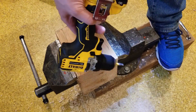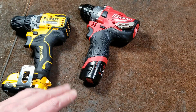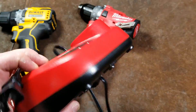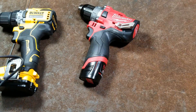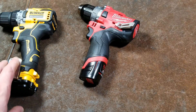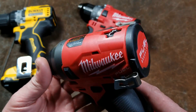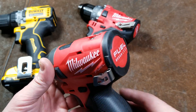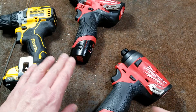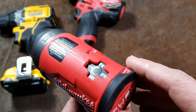With the 2-amp batteries both tools are closer than expected, but Milwaukee is still definitely more powerful. The DeWalt sets came with a 2-amp charger while the Milwaukee has a 3-amp charger, but it's single voltage whereas the DeWalt chargers are dual voltage and will charge both 12-volt and 20-volt batteries. The Milwaukee set also comes with a super compact impact wrench, and the bigger difference in the set is that the Milwaukee impact is not only more powerful than the DeWalt impact but has a better four-mode control system.